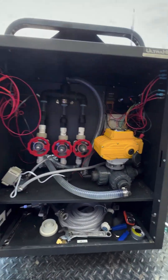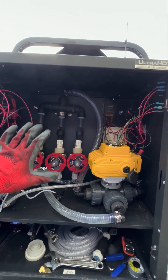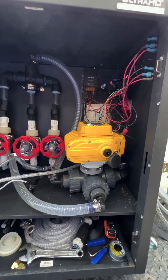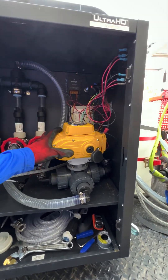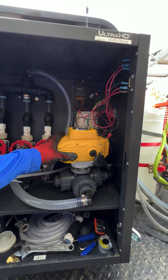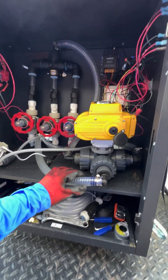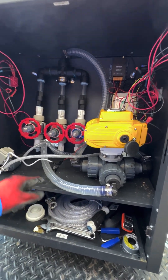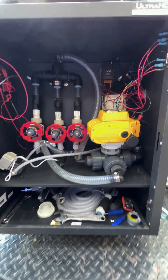This is my setup. I've got a proportioner, which I'll explain possibly in a different video. I also have a three-way electric motorized ball valve — this is industrial quality. It costs over $700 new. You won't need a pressure washer anymore to wash a house. This is a three-quarter inch outlet, three-quarter inch inlet, and one-inch inlet over here.